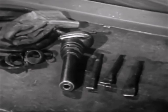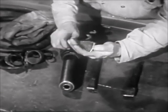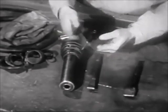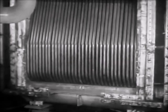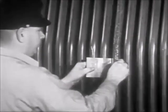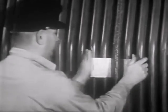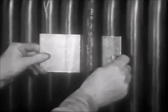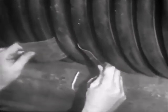The tools necessary for this procedure are an air hammer and a flat chisel. Be sure the chisel is sharp. To avoid damage to other tubes in the event the air hammer slips, bend a piece of heavy gauge sheet metal behind the tube to be removed. At the location of the cut, leave the tube exposed for the cutting tool.